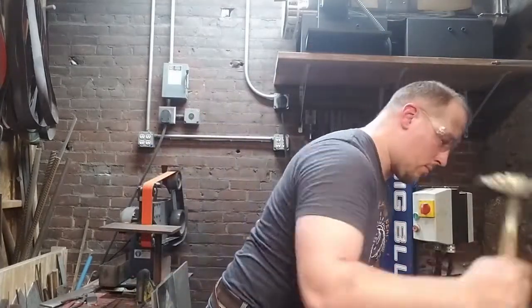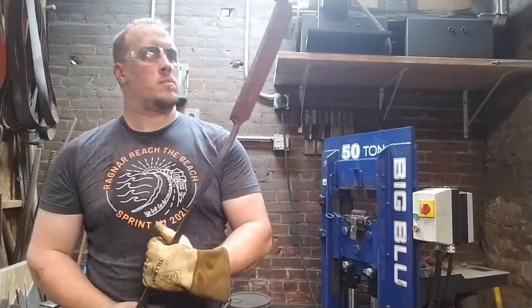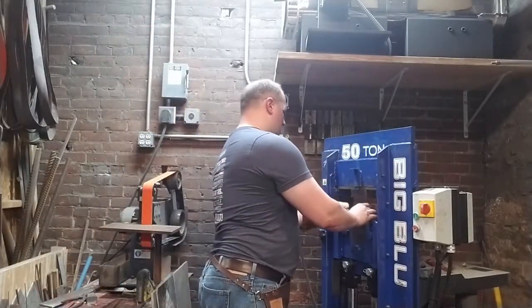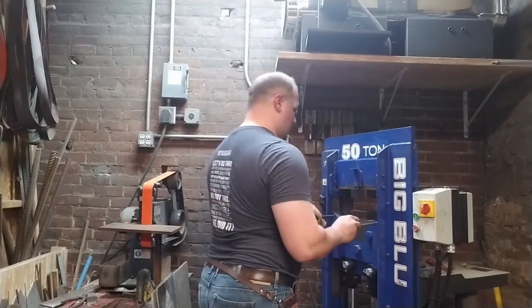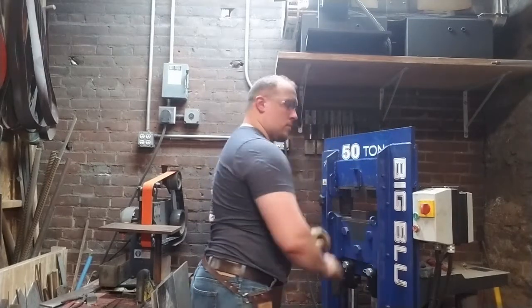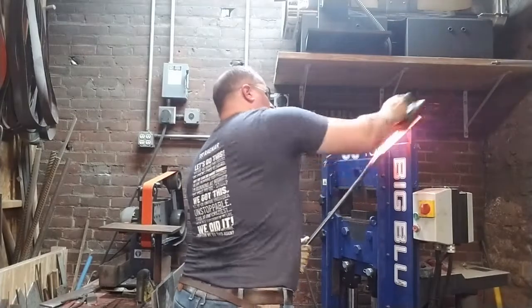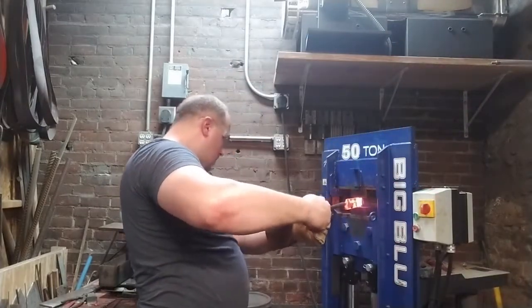And that is more gentle on the welds, but actually the sharp faces of my flat dies will cause bumps and ridges on the face of my surface, and can cause cold shuts. That's really just a function of how those dies were made. But they're very good dies.